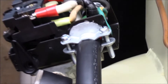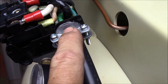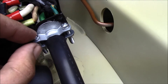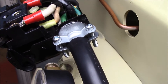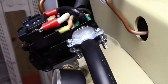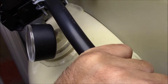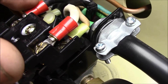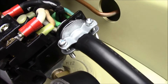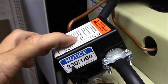I got all this cleaned up and when I first got this compressor I couldn't really fit a connector on here, so I ended up taking a Dremel tool and opening that up just a little bit to where it would fit a three-quarter connector — I always call these a romex connector. This is a number eight gauge cord I used here, which is probably a little overkill. It's pretty tight in here but I've got it all situated now so the cover will go on and we should be in good shape.